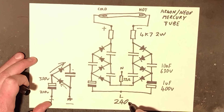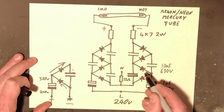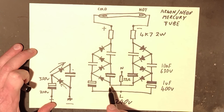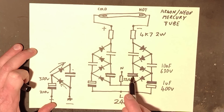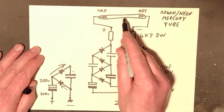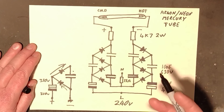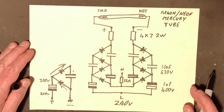This circuit is designed to operate on roughly 240 volts. If you swap the capacitor out for a 1 or 2 microfarad non-polarised capacitor, it will multiply up further. The original power supply this is based on actually had a 1 microfarad and then a film capacitor, and it drove much longer lengths of tube — five or six feet — because once you've broken over the voltage drop across the electrode, the actual drop through the gas isn't too bad. They tend to measure neon tubes in feet because it's an old technology.